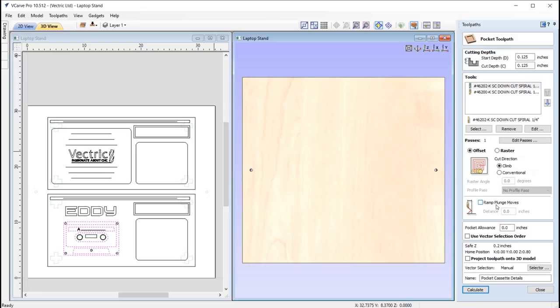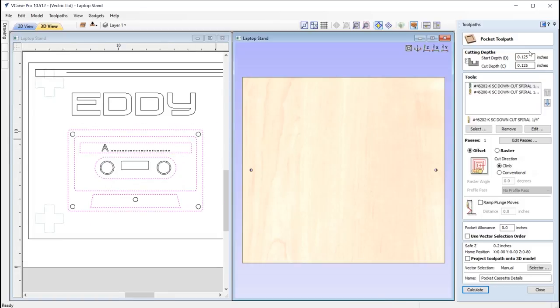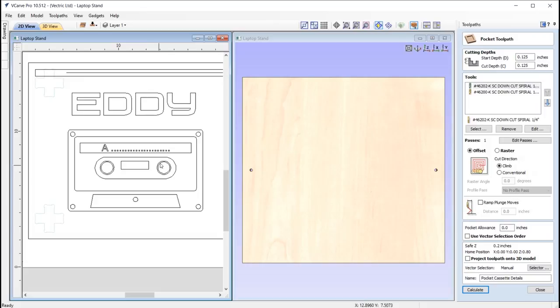Okay, so if we double click on that, you can see we're actually using two tools here to cut this out. So first off, we've already machined away an eighth of an inch for the acrylic to sit on top. Okay, and that's going to rest on top of this design. And so we're going to cut through between all of these vectors here by a further eighth of an inch, and we're using two tools, a quarter inch and an eighth, so that the eighth can actually get in to the small areas, for example here at the bottom and over here and around some other areas